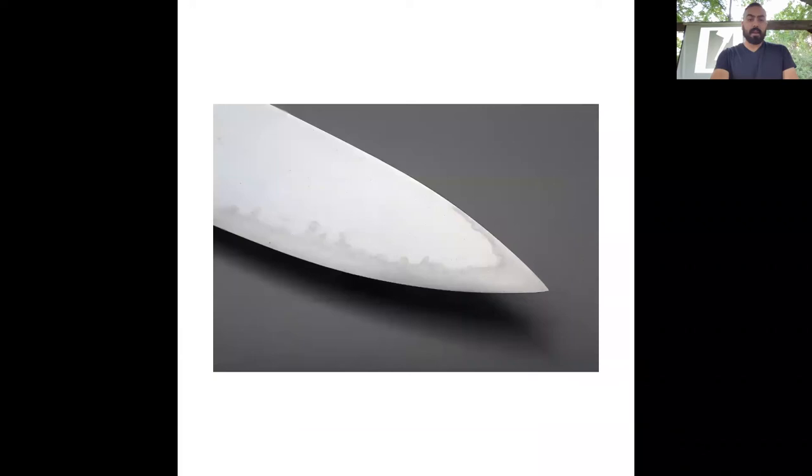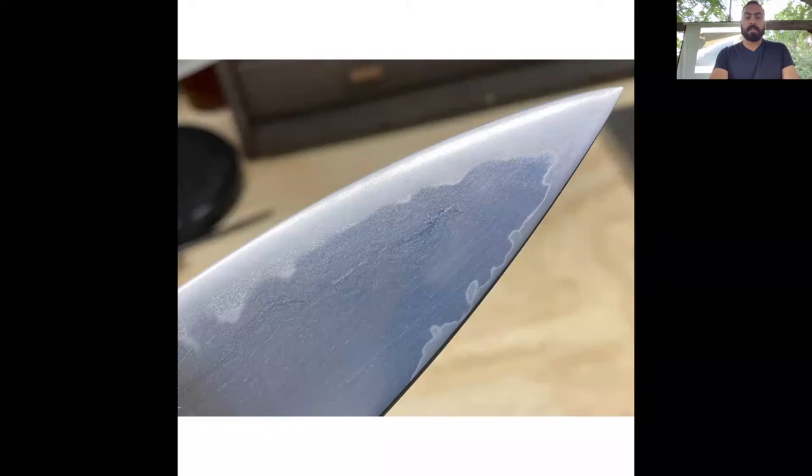And this particular piece is really a good example of the best steel that I can make at this moment in time. It is really, really dense. The pattern is like 144,000 layers or some crazy thing like that. The activity that you see in the steel has these really dense, vibrant crystals that are actually a transitional zone between the hardened and the soft steel. And when it's polished out properly, you can actually see that. You can see with your plain eye that this material is of really, really high quality.